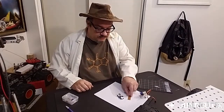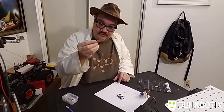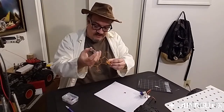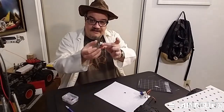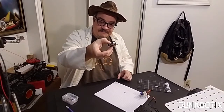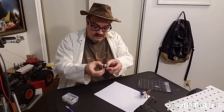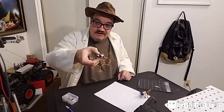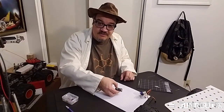Now I have my little piece of carrier board PCB cut to just the right size. I'm going to solder the ultrasonic sensor to it — it'll sit something like that — and I've also got a little four-pin header that I'm going to solder to the other end. That will allow me to attach wires and run those wires back to wherever I need them. I'll get to soldering this next and then we can get the whole thing mounted up.